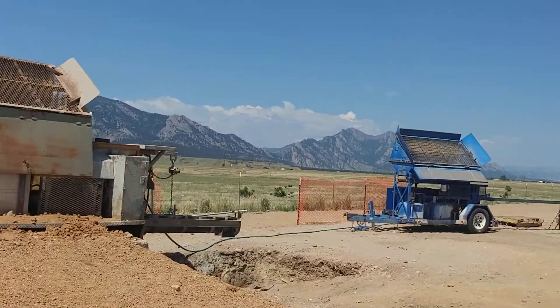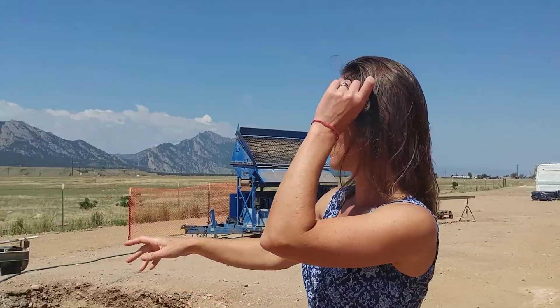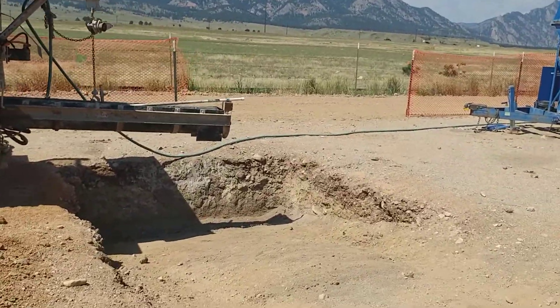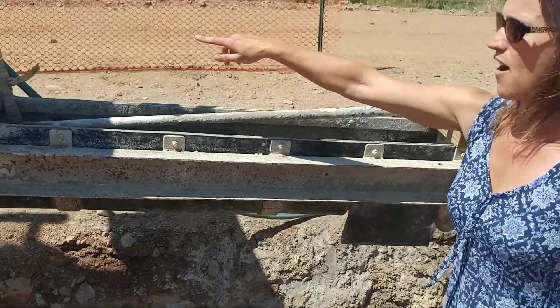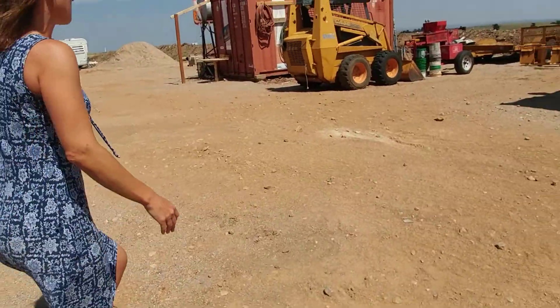Here we have a separate hopper. We can either put cement or lime, or a combination of both, into a smaller hopper on the belt at a certain speed. It allows us to mix that cement and lime into the perfect ratio — usually around seven and a half percent is what we're after. The auger pushes it through, and water is added at just about ten percent for the compressed earth blocks, so it's a nice, fairly dry mix.